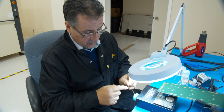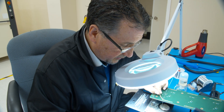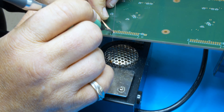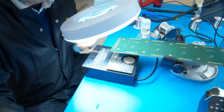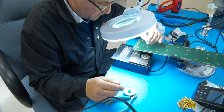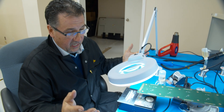Then you take your solder wick, make sure you have a nice clean tip, and put it right up against the corner. Take your iron, put it into the corner, give it about a second, and pull the wire straight up. You can see the solder float up through the solder wick and the hole is now completely clear — no stress on the pads at all.